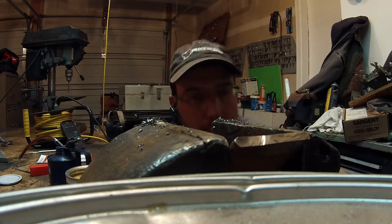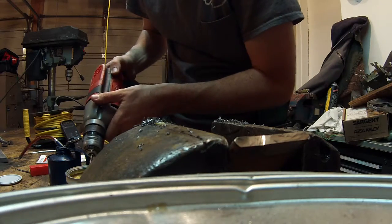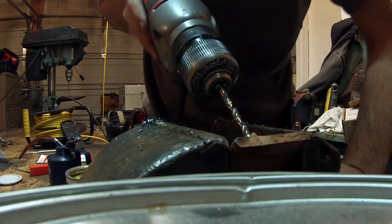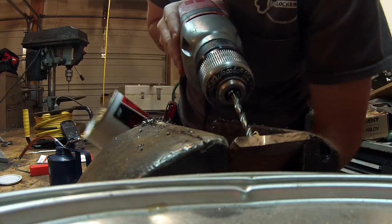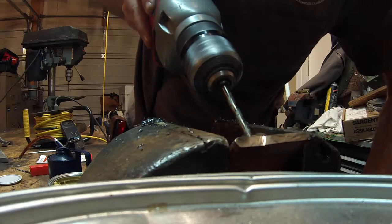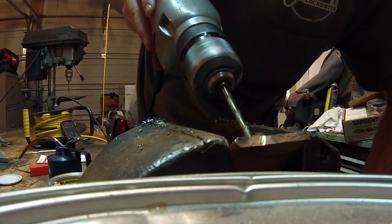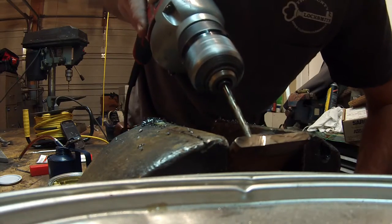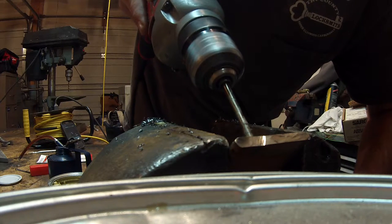To do a perfect example of that, here's the leaf spring. This is leaf spring steel. If anybody out there has ever tried to drill hardened steel, it is not very fun at all. So we put a little bit of this Cut-It paste on there — this is also available there. It's kind of a waxy material that seems to have some petroleum product in it, and what it does is it melts right in there as you drill. Spring steel is pretty hard steel to drill.